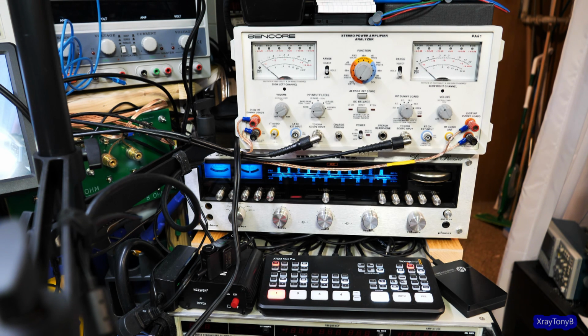I think it might be a nice deviation from some of the standard approaches, like putting a 1 kilohertz signal in there or a swept signal in there and reading the distortion and all that. I think it would be very interesting. The other thing is we will be able to look at distortion on that scope as well. If you want to see more of the MDO 2204, let me know and I'll show you some more functions of it, because it's really a good piece of test equipment.